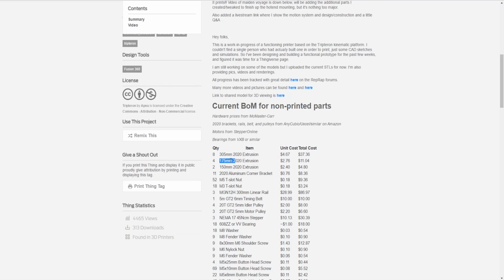It is too heavy. It is limiting your acceleration and your print speed for not really that big of a gain. Because that's the thing, it's like a double-edged sword. If you're going too heavy, then you're adding more forces that material needs to withstand. If you go lighter, then all the forces you have is just the momentum, accelerating it from a positive acceleration to a negative acceleration, and changing it to a different direction. All you have acting on it is its mass. So the lighter the material and the stronger the material, the better performance you're going to get. And on this one, I was thinking maybe some 3DX Tech carbon fiber PLA, where it's amazing in flex, and it's very resistant to distortion.